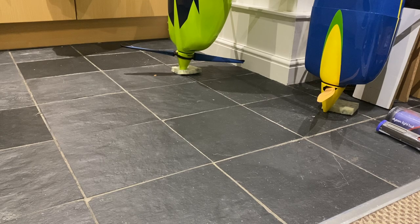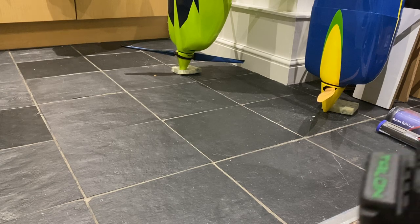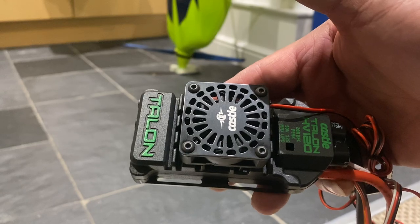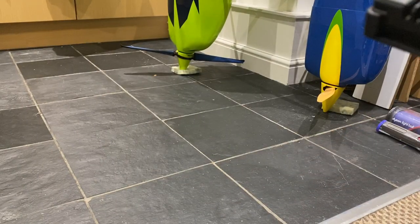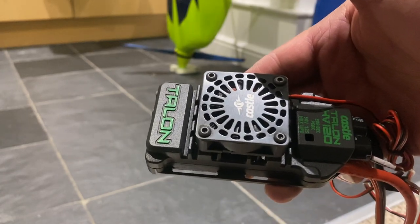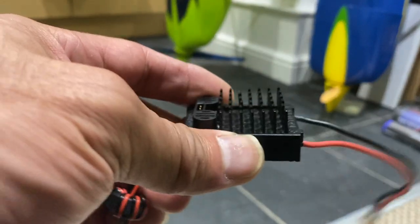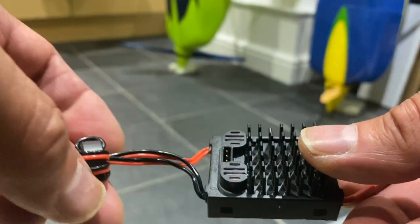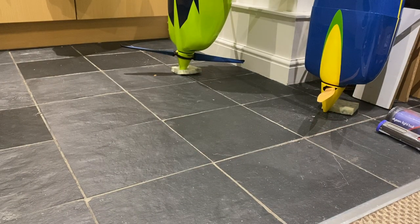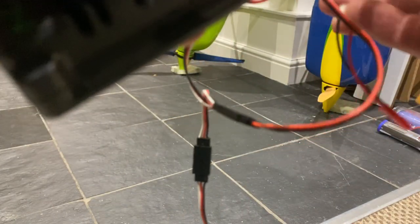I just thought I'd do a quick video on this, purely because there's not a lot out there referencing the Castle Creation programming card. And as I say, the Talon, this one here, Talon 120 Max, has a 20 amp continuous BEC already built in. So don't try to put a BEC in. If you try and put a separate BEC into something that it's already got a BEC, what you will get is your BEC will get really, really hot and warm. So don't do it. The only way you can do it is by removing the red wire